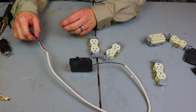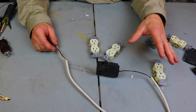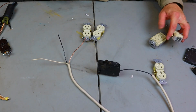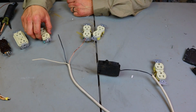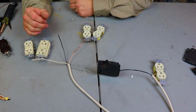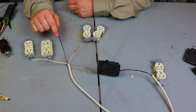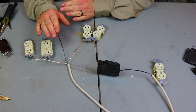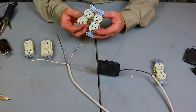So let's say you have a 20 amp GFI or a 20 amp receptacle — can you put either of these on a 14 gauge wire? They're rated 20 amps, right? We talked about how you can put 15 amp devices on 12 gauge wire in certain situations, but can you put a 20 amp device on 14 gauge wire? The answer is absolutely not — never, on any given day.